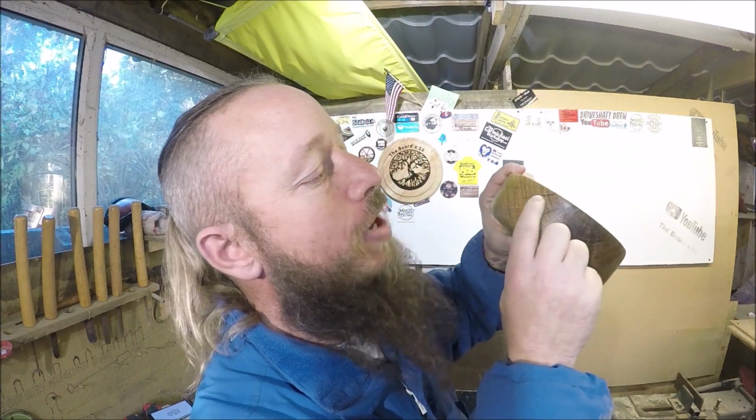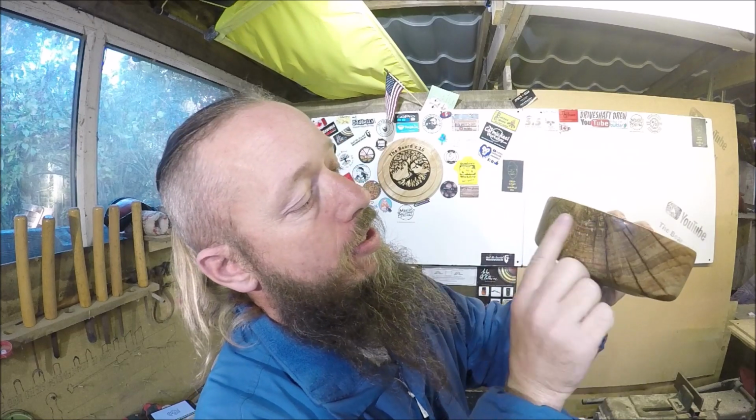Now what you didn't see on video, and yes, we've all been there, so don't say you haven't, I forgot to press record. What I was doing was stabilising the end grain because there's a few little cracks here and there. I was stabilising it with super glue while it was on the lathe, so I was spinning it and trying to pack as much super glue in, or CA, and activator as possible, and it seems to have done the job, so it's alright.